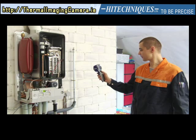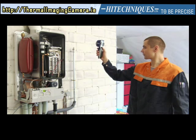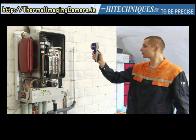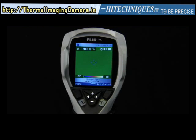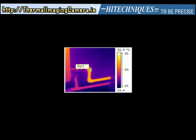For spotting hot spots, first point the camera to the selected target and point the crosshairs to the hottest point in the field of view. This appears bright white. Now you may press the right selection button to lock the temperature scale. In this way you lock the temperature scale to the really interesting temperatures of your target, which allows easy inspection of your object.